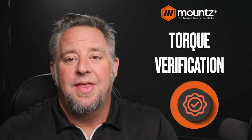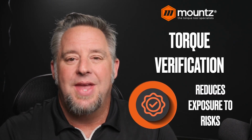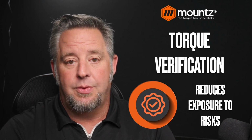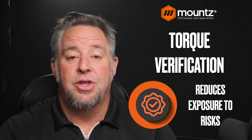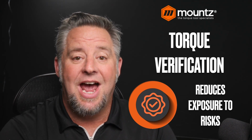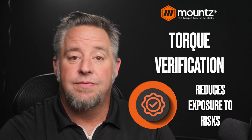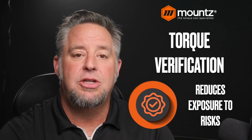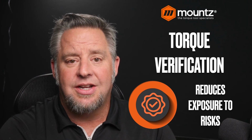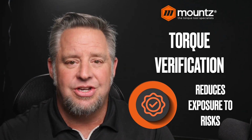And so this allows us to use what we like to call torque verification. And this really helps to eliminate or reduce some of those risks that we talked about at the beginning, some of the torque failures that we might see. But the big component to that is we can actually see how our tool is performing over time if we have a system set in place with different frequencies of testing our tools in between the actual calibration dates of that tool. And so we can check to make sure that the tool is still within its calibrated limits through the torque verification process.